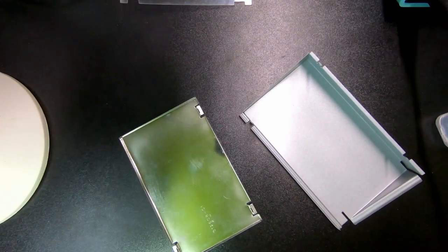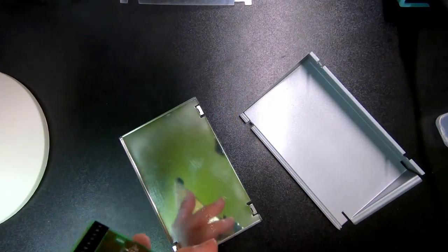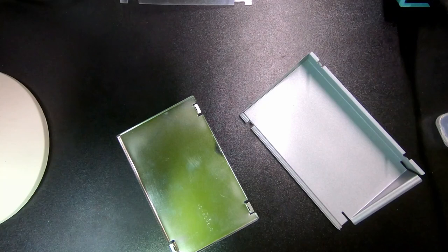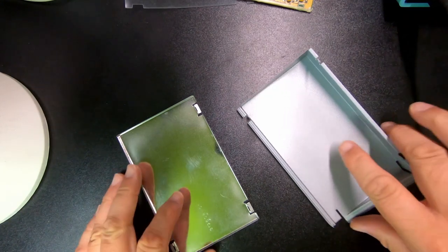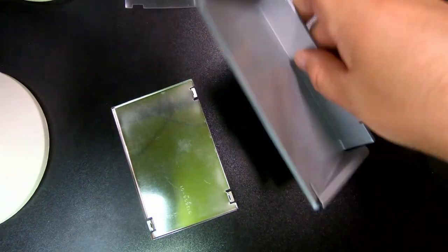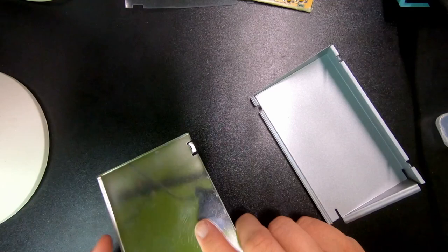But I have to remember that end that had a bit of tape, didn't have it on the other end. Theoretically speaking, this is like an earth band. Now one has to realize that when Commodore started, they had this EMC protection on it. But the majority of these memory cards, even the Commodore original, people have opened them and thrown these in the garbage. Yeah, I don't think they're super technically needed. And the regulations they had for electromagnetic interference or electromagnetic compatibility was probably like zero.